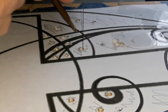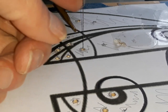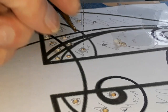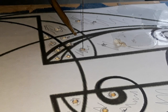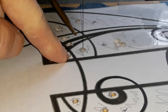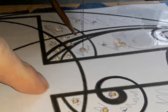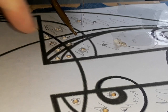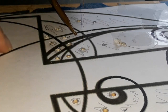We've fed our blade through - you get that little twang of the blade, which moves a bit of wood. That's the sound you want to be listening for - that tells you you've got the right tension. We've got it onto the clamps; I have to use adapter clamps for pinless blades on my old scroll saw. We'll cut this section out, then move to the next hole, and so on. Always start with your middle cuts - you'll be tempted to go around the outside first, but that makes things weaker. Start the harder cuts in the middle while you've got all the surround to keep it in place.